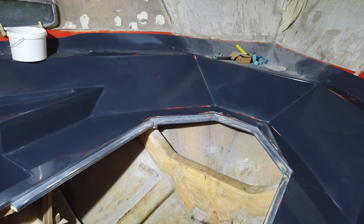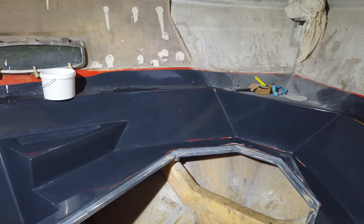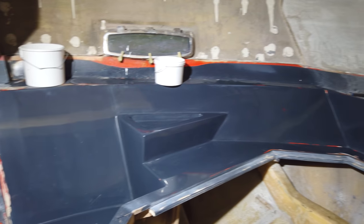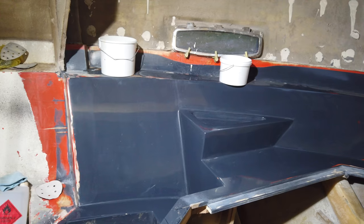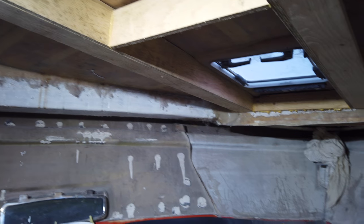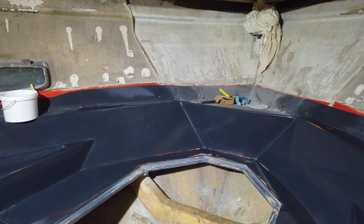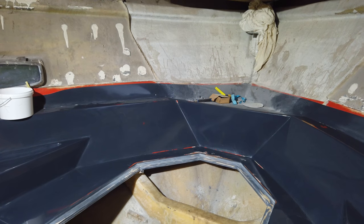mould that side. And then we're also going to put up some insulation because it's pretty cold outside. It's about 4 degrees at the moment, and we need to be moulding at probably around 20 degrees. So the plan is to put some insulation up in the ceiling here, just some fibreglass, and then we're going to create a curtain down here with some polythene, so that will create a small space that we can heat and take a mould. So we'll leave it for this evening and we'll be back in the morning.